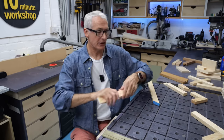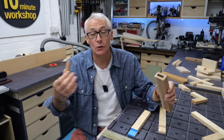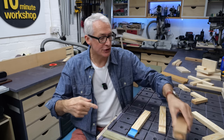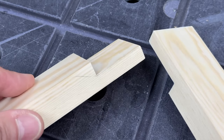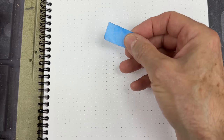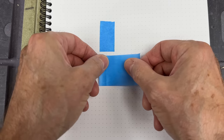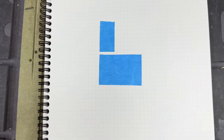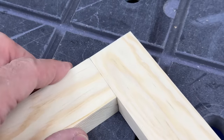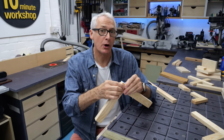What's happening there is you've only got glue on one small face. That's where something like a loose tenon comes into its own, or dowels or biscuits — they just allow that much more glue to be inserted within the joint. Another way to do it is a simple half lap joint, which gives you three times as much gluing area as that simple butt joint, because you're removing so much of the material and it all joins together really well. Three times as much glue doesn't necessarily mean it's three times as strong, but it means it's going to be much better than a butt joint, and the half lap has little rebates that locate themselves against the edge of the other workpiece, making it a much stronger bond all around.